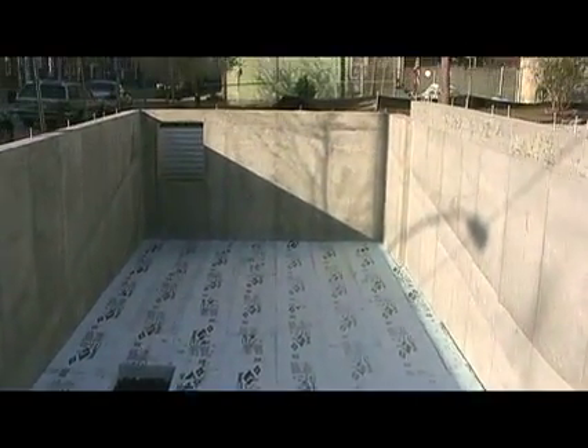On top of that gravel is where we start with our insulation. We're going to do an R30 insulation on the entire basement floor, which is a lot of insulation. This insulation will actually cap the edges of the footer to prevent thermal bridging.